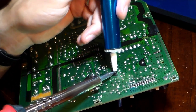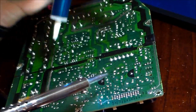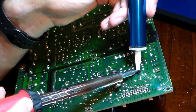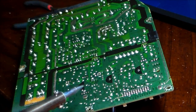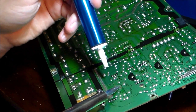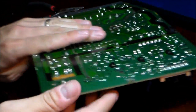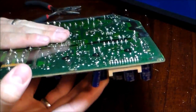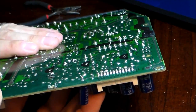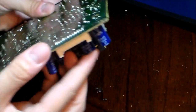Take out the negative legs. Heat up the pin like that, and on the other side take the solder plunger and push down — done. Do that for each one. Then on the other side just wiggle the capacitor free so it breaks free of the board. Now it's out of circuit. Do that to all of them. Make sure the pins are straight and not touching the board.